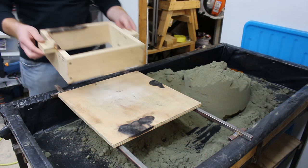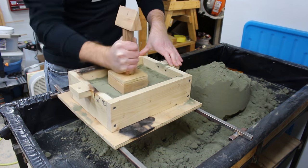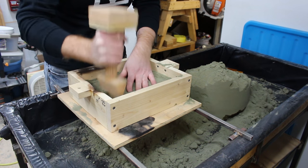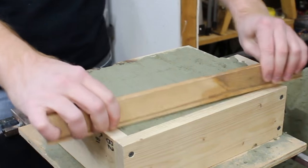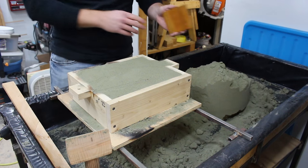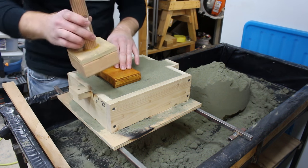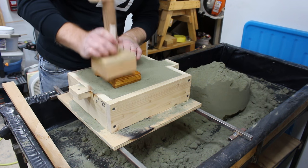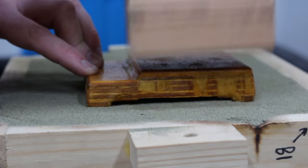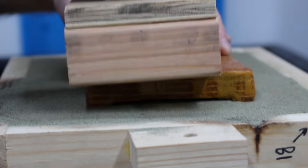I put a molding board on the two cross pieces and then put the drag on top of that. Then I fill it with sand, ram the sand into the drag, and clean up the top. I line up the pattern pretty much where I want it and tap it down into the drag, which allows those protrusions off the bottom of the pattern to be recessed into the sand.